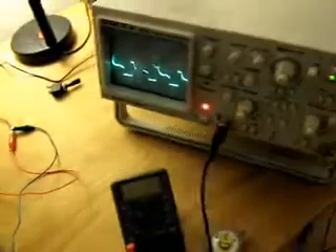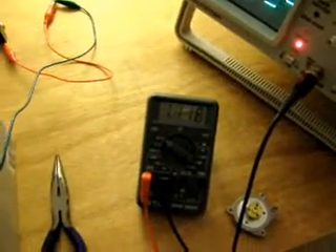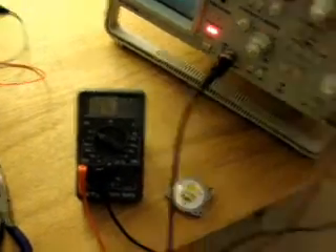I'm getting 220V spikes off that, which is pretty good. This is connected to this battery here which I've just drained using an inverter and a light, down to really flat — a lot lower than I normally would. While it was draining it went down to 7.9V. I never normally would do that, but I just wanted to see what would happen out of curiosity.